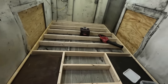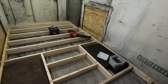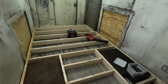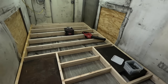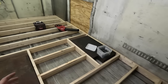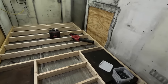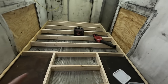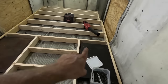Tomorrow before I spray my insulation, I'll run down through here with a straight edge and true this floor up. The truck's obviously not level and never will be when parked, but I just want it to be straight and true — not wonky. I'll use big screeds or six-foot levels and make it as flat as possible. Then I'll use those L-shaped aluminum brackets to attach to the floor and true it up through the actual floor joists.